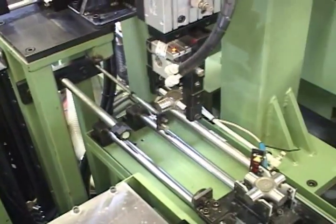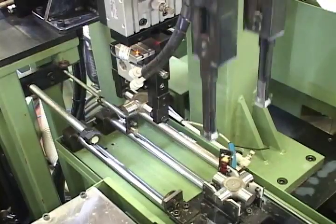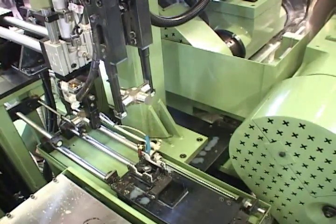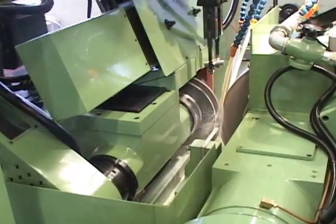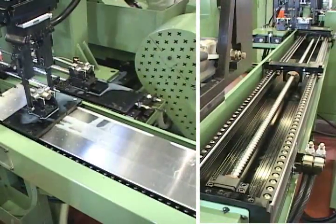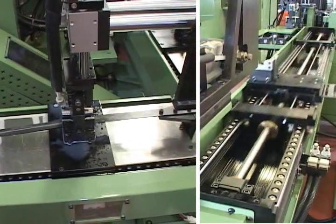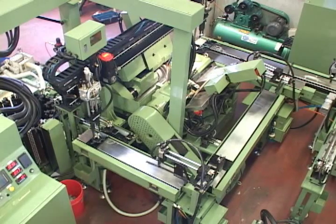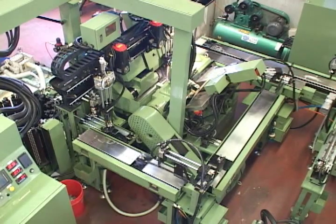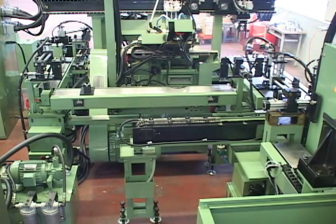The midway station is a mechanical robot arm, which grabs the workpiece from the stock tank and transfers it to a V-type jig. Then the main mechanical robot arm moves it into the grinding position. Two axes moving simultaneously on the loading device with high-precision gear and rack. Two servo axes moving simultaneously for faster speed with a smooth loading process on both sides.